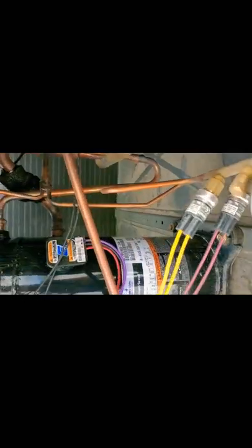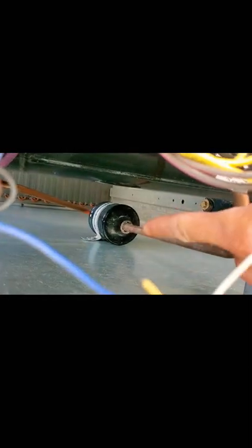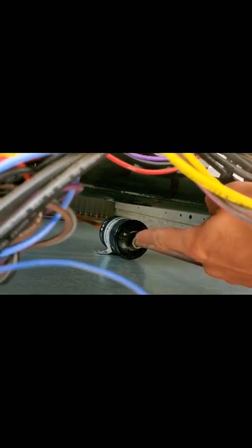I have it actually opened up now. I'm just going to show you a few of the components that are major to this unit. That's a compressor, a scroll compressor. And there you'll see your reversing valve. That back there is your line dryer — once the refrigerant's filtering through, that actually filters your refrigerant so you don't get a bunch of stuff going back to your compressor.